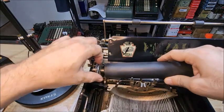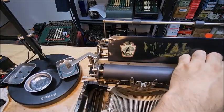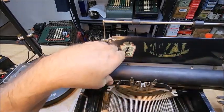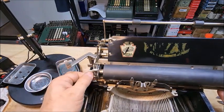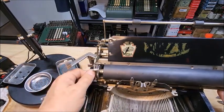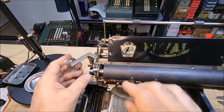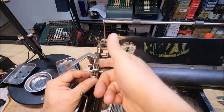Put the ratchet back on top of the regulator. Put that back in. Put the platen rod back in over here. Collar in place. There we go. Centered and feed it through. Now, if I set it down to 1, works just fine. Set it down to 2. 2 clicks. Set it down to 3. 3 clicks. And completely disabled. And you'll see that even if I push this off to the side, it's not going to fall off the regulator. Now I can also, to a limited extent, flex the regulator back over.